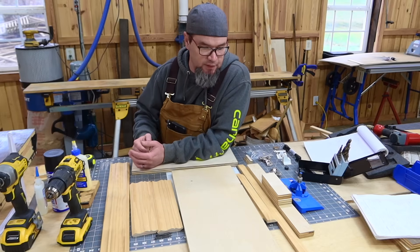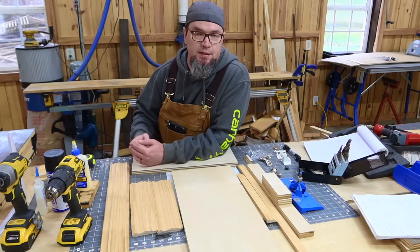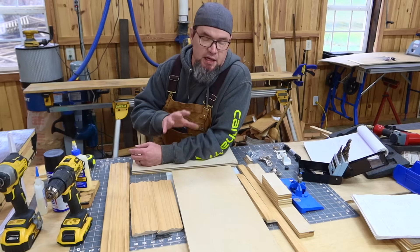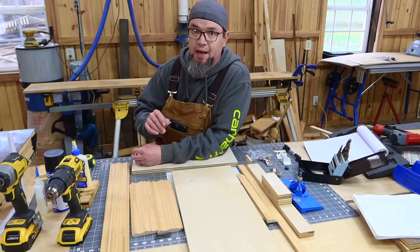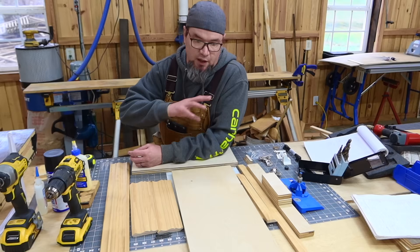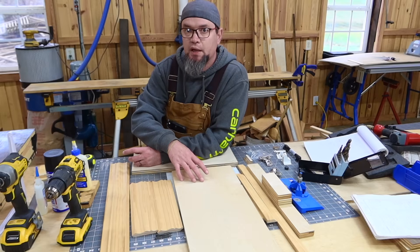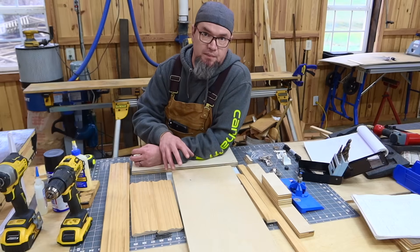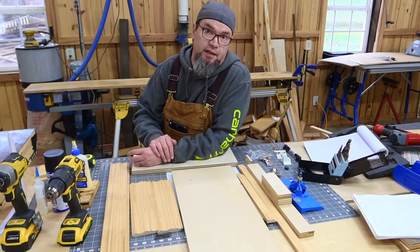Let's put this together and go through some tips for speeding up the process. Staining is actually easier if you do it before assembly — even though you'll go back and fill in some nail holes. When I was building these every day, it took me an hour and five minutes per unit, and staining was the most time-consuming part. I bought a Graco airless sprayer with some of my profit and it knocked out a ton of time.